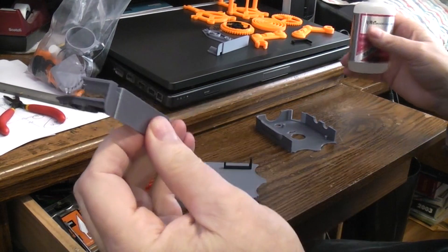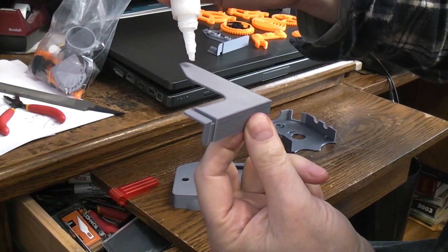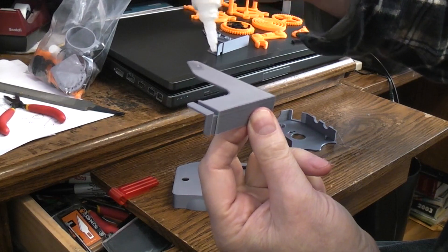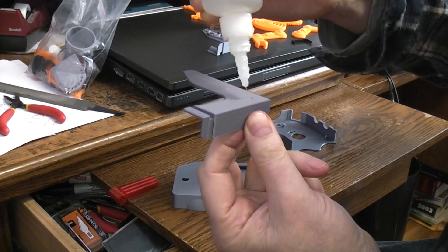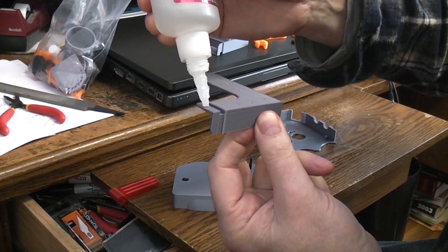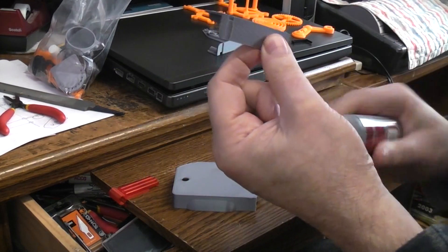When I take the arm levers off the bed, I normally take a flat file to remove any elephant's foot, or run a blade in here to clean the trough out. The large part goes on the bottom, the small part up top, and it should move very freely. When we glue the detail piece on, make sure we don't get any glue on that lever — only on this piece. It doesn't take much; this is just a cosmetic piece.